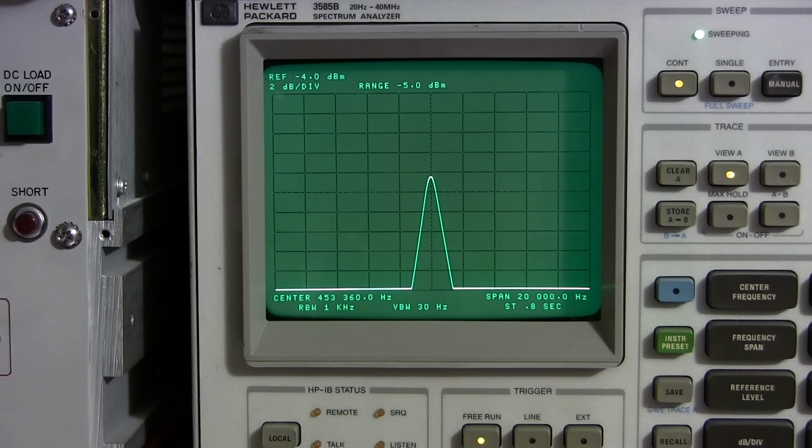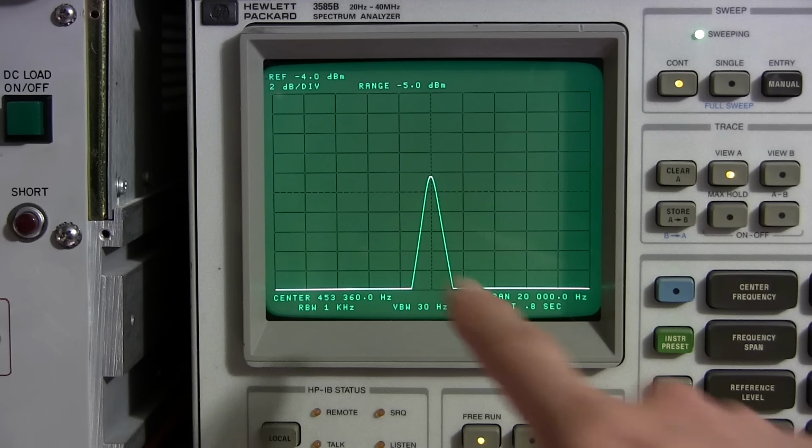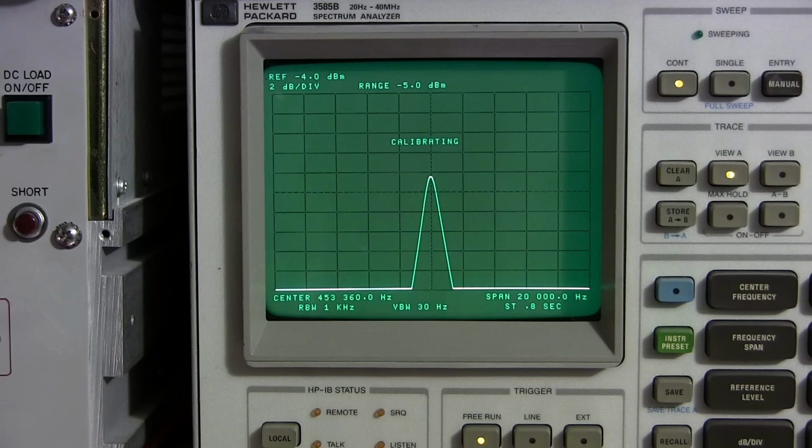The crystal selectivity knob is at position number 2. The crystal phasing is pointed at 12 o'clock. The sensitivity control on the receiver is at a position where we can just see a signal on the screen here. The CW tone control is pointed at 12 o'clock, and this is important. It needs to be pointed as close to 12 o'clock as possible. At this point, the manual AVC and BFO knob is pointed in the manual position. And that's pretty much all we need to worry about right now. Of course, it's in receive mode and it doesn't matter where the limiter really is at this point.